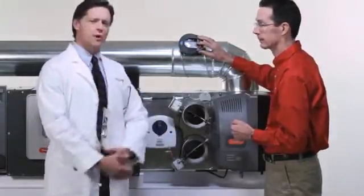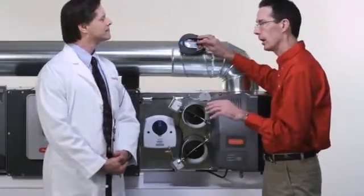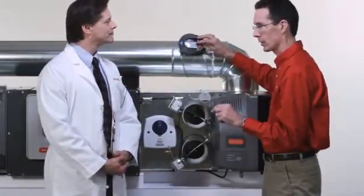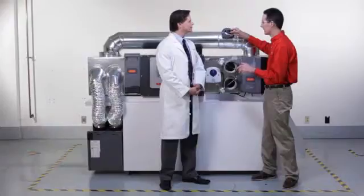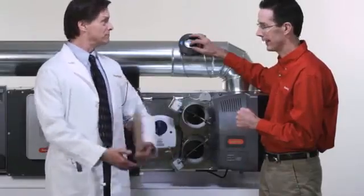How can I make sure that all zones are properly set? It probably is, but you can be sure by making only the smallest zone call for a fan. When it does, this will open — and listen. When the register is quiet, it's set properly. So that's it? We're done? Yep.